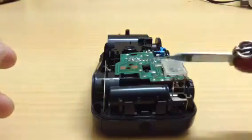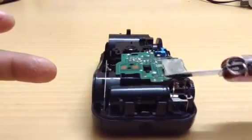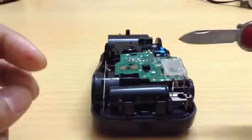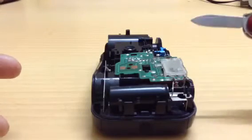If you want to make sure the capacitor is discharged, please short out the circuits like this without touching it directly, otherwise you could get hurt badly. Wear protective clothing and always protect your eyes — I wear goggles for this experiment.